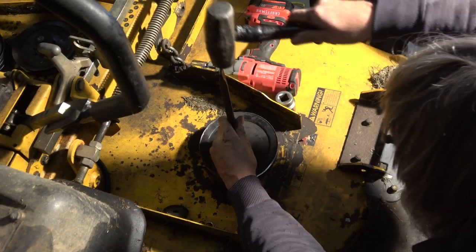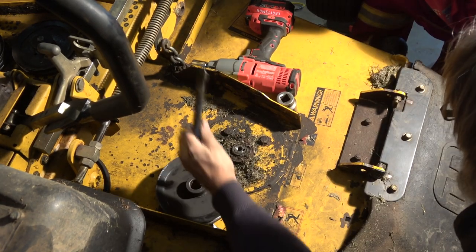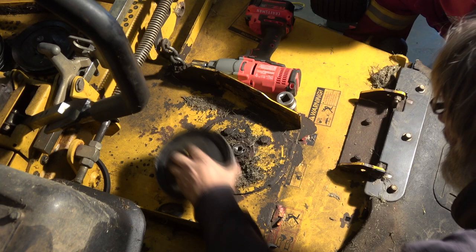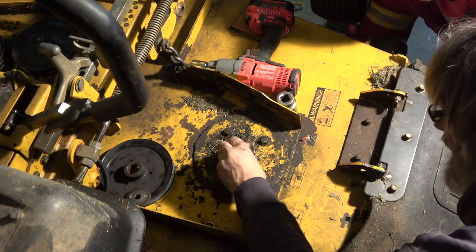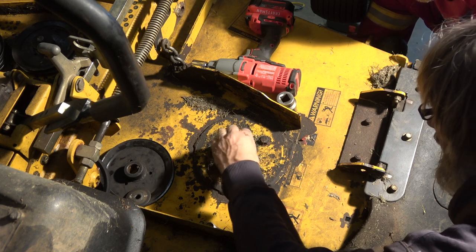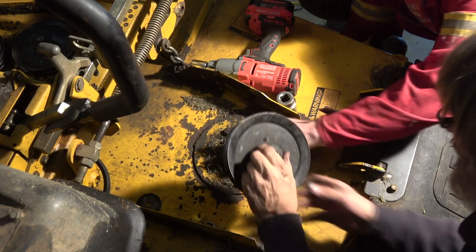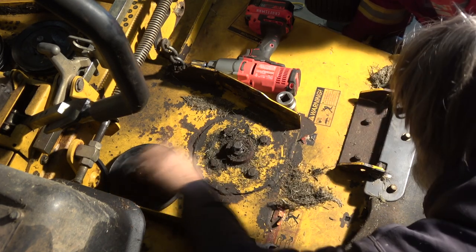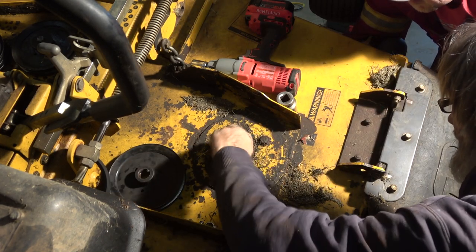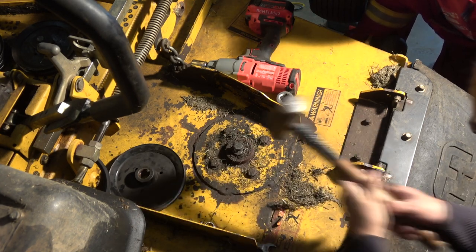So now it's moving and the keyway is staying in place, so that's good. If you had a little bit longer bolt I would suggest doing it that way. I'm getting afraid now to pound the bolt — I have quite a few threads in there. You don't want to pound on that bolt if you only got one or two threads. You got to watch — if you go too far down, the head of that bolt gets caught on that keyway.